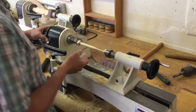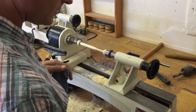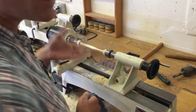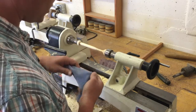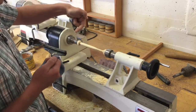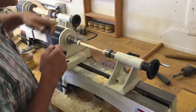After the 10 minutes of letting it dry out, crank up the speed a little bit to add more friction so it heats up the wax. The wax will actually melt into the bat and give it a nice shiny finish. Be careful — you have spinning material on both ends so it doesn't get wrapped up, and make sure your tool rest is out of the way.